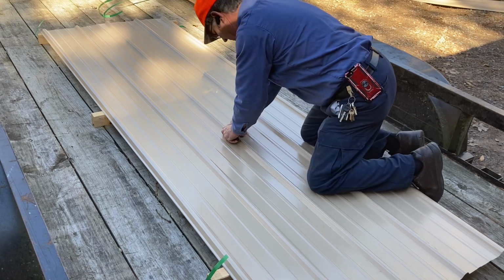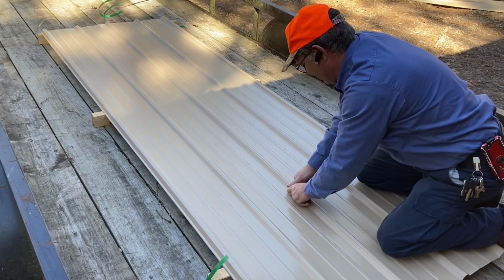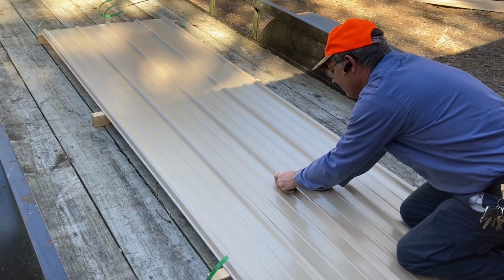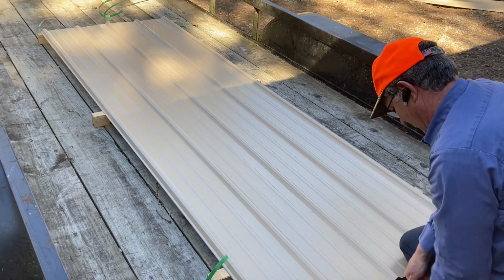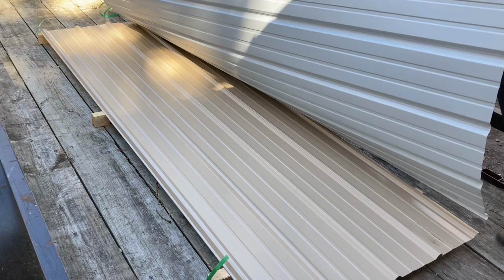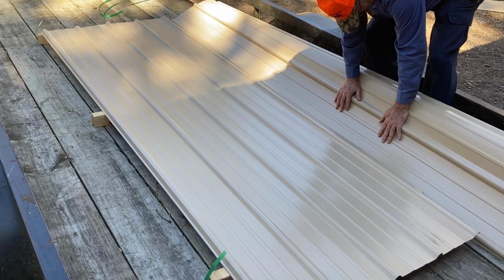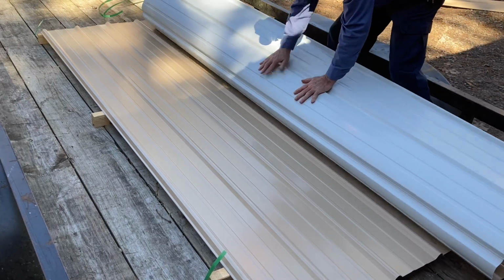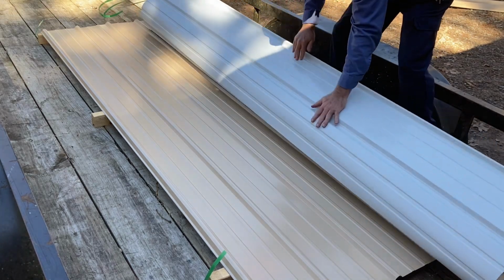The doors needed 2 full sheets and a half of a sheet plus 1 inch. So I wasn't able to split a sheet down the middle and use it for 2 doors. I had to rip a sheet and throw almost half a sheet away. Of course, I didn't throw it away, but I used it for other purposes, or will. But here, if you haven't seen my other video on putting sheet metal on the building, I'm just scoring this with a regular old razor knife and then bending it at that score line, and this hardened sheet metal just snaps in two.